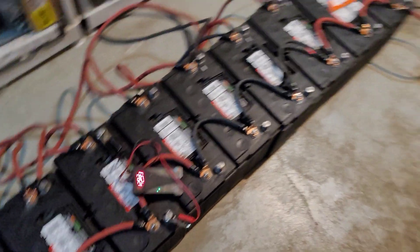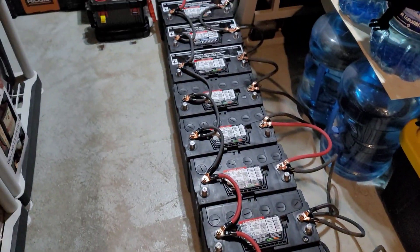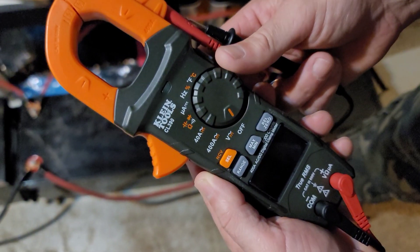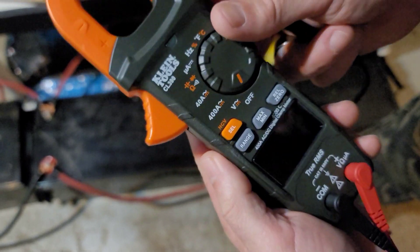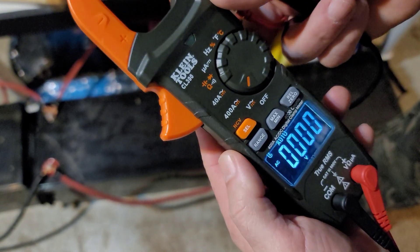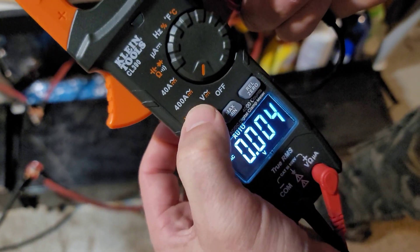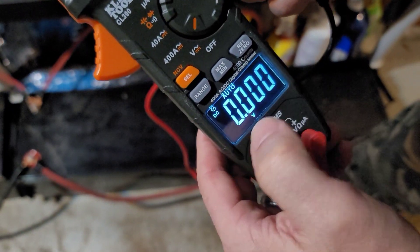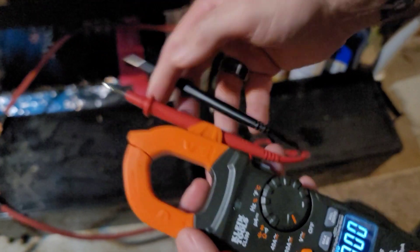We're going to start at the very beginning of the AGM and show the voltmeter all the way up to show how every single battery is now equal. I'm using the Klein Tools CL390 — so far this has been an excellent little tool. When you first start off you see it's on AC; press select and that gives you DC. It's on automatic, so it's automatically going to test what you're testing. Let's go ahead and follow these batteries.